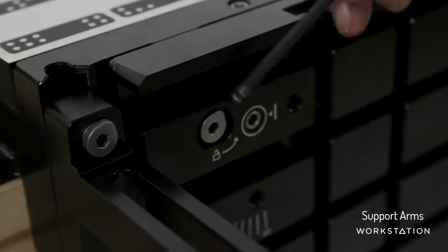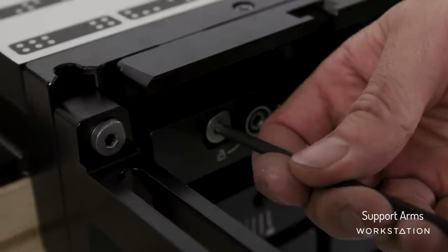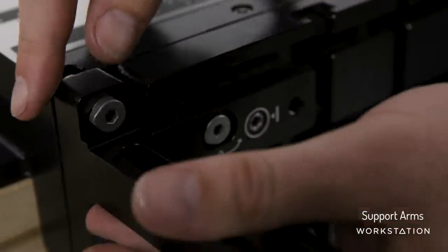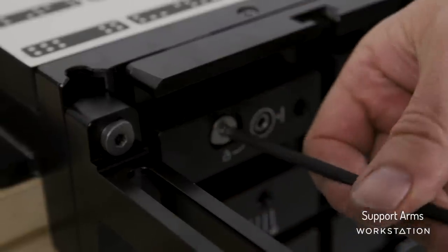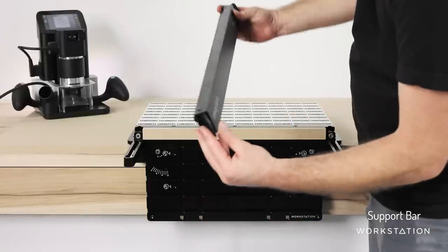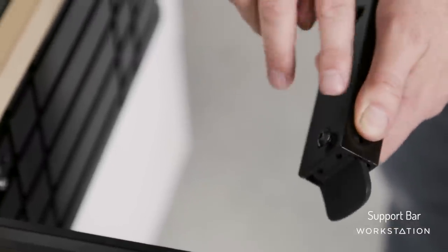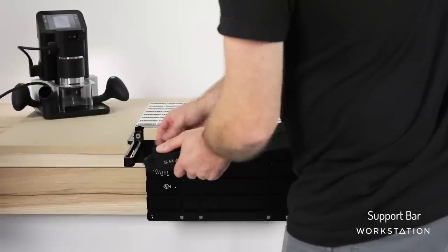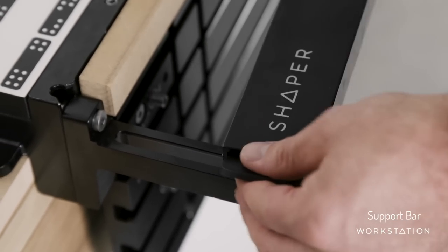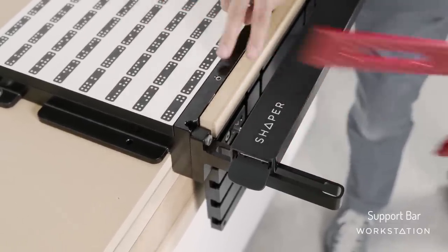Here's a little detail I like: the locking screws have a little elongated point which gives you a quick visual indication of what state they're in — currently locked, unlocked. So you can see loose, loose. And then when you lock them, they both face in basically the same direction. This is the support bar. It has some little clamps that slot in here to quickly secure it in place. The pressure these apply can be adjusted — they should be set appropriately from the factory, but if you need to move it, you can tighten and loosen them. These have a little nylon attachment so they don't move on their own. It's a very sturdy, very flat, very consistent surface that matches our tape surface.